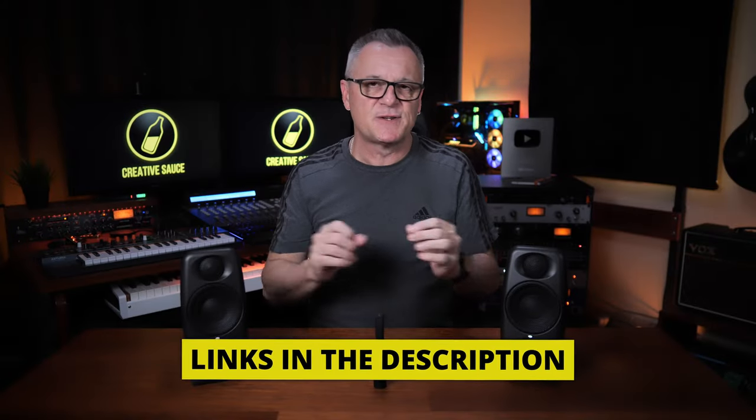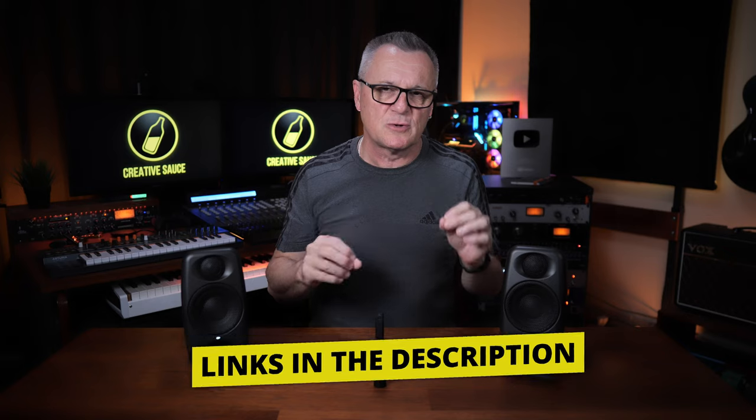You'll need to check the links in the description because at the time of making this video I'm not sure if you can buy these monitors individually. However, if you buy them as a pair, you also get the ARC calibration microphone from IK Multimedia. It's a specialized microphone, and when you use it with their ARC 3 system, it will measure your room and calibrate your monitors with frequency response changes so they're best suited for your particular listening environment. You can calibrate by hooking the microphone up to each speaker and pressing button combinations on the back, or you can use the software, which is my much preferred method.